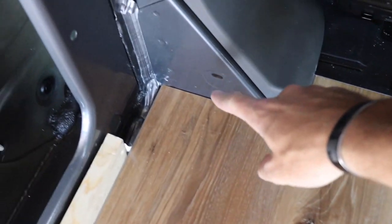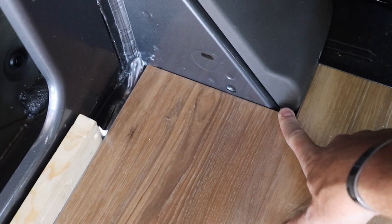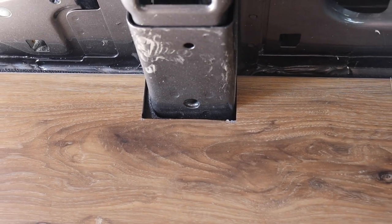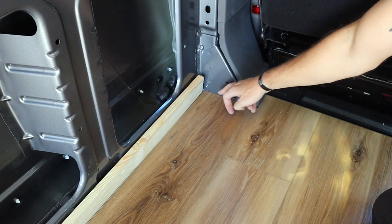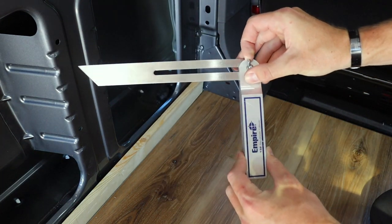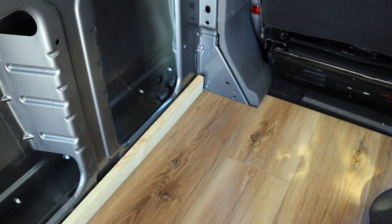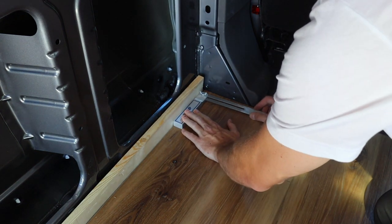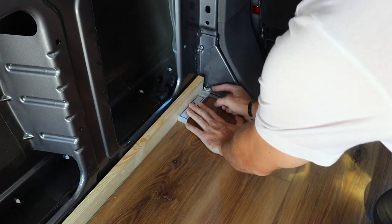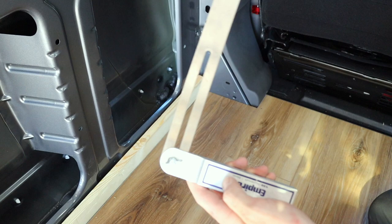In the Ford Transit, this board right here is not a perfect 90-degree angle. To get it trim and flush all the way across the top edge, I'll show you the trick I used. In order to find this angle, what you're going to need is a T-bevel — I'll leave a link in the description. It's designed for helping you find whatever angle you need. What I did was lay the board out where I wanted to start my row, put the T-bevel right up against it, slid it forward, moved it until I got the right angle, and tightened the wing nut down.